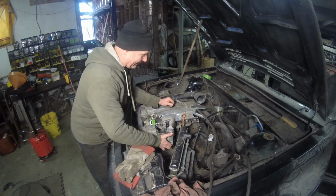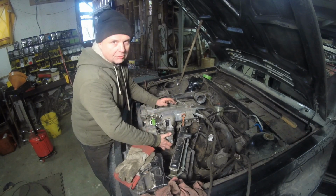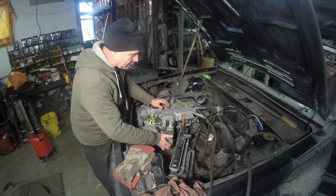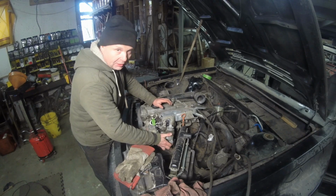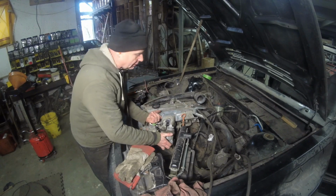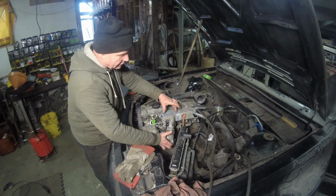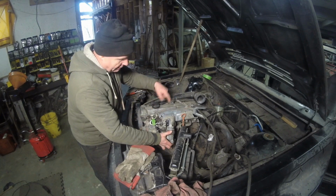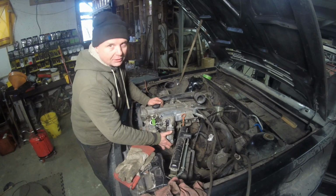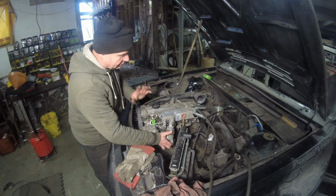Now's the moment of truth. Big thing is, I just give it a rough cleanup. I have to go over it with a stainless steel brush and all this other stuff, but I just give it a quick flap wheel brush because I'm not looking for it to hold. I am looking for it just to stay steady. I'm going to try and make it as flat and as equal as possible, and just try and tack this in with the TIG welder. Whether or not it's going to really do a good job, it's not, because I'm not going to use filler rod. I just want it to flow in just for it to be stationary.